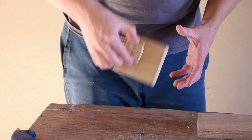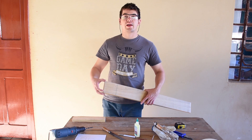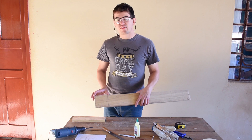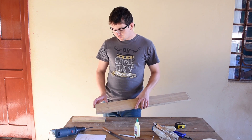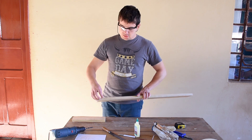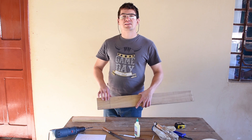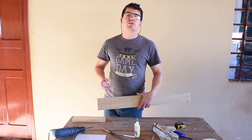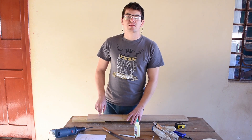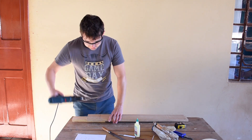And it's done. Now I'm going to do the lateral piece. For that, I mark three and a half inches on the bottom, two and one on the top, by four and one-fourth long. But before I cut, I'm also marking the back support here, and I'm going to draw the holes. These sizes are in the drawings and will depend on the size of your camera. I'm using a 7 millimeter drill bit — it's around 9/32nds of an inch.